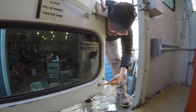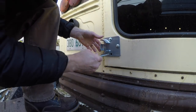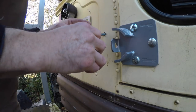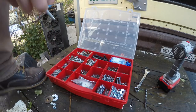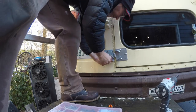It's worth noting, in case you are installing one of these babies yourself, that you really gotta dial in the two sides of the hasp. If they don't match up perfectly the lock just won't slide on. So on the left side I slipped a few washers around back of the bolts and then the two sides lined up just right.